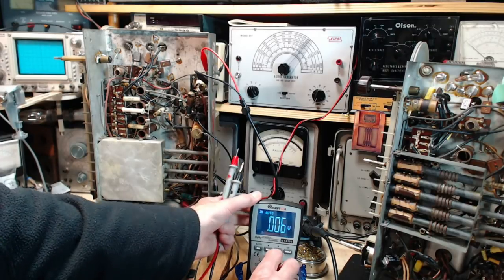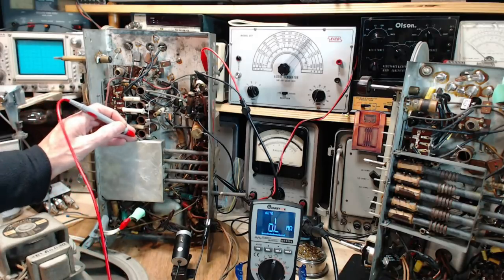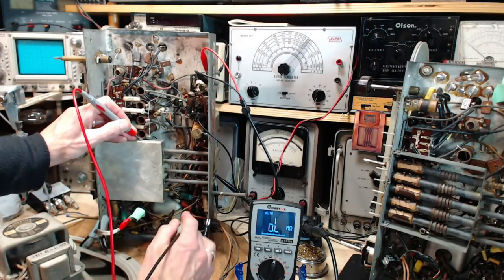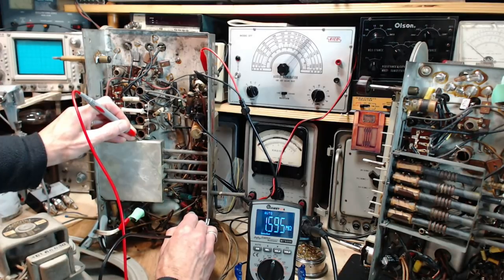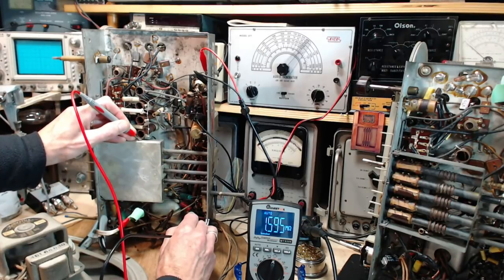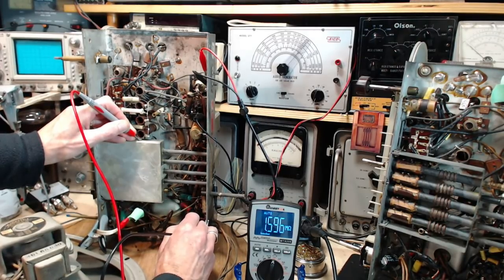So a resistance first. I have not concluded. Be a smart move. Down to the chassis, on this side of this capacitor. So I'm expecting this to be 470,000, 4.7 million, 47 million. Well, it's not going to be 47 million, that's pretty much an open circuit. 4.7 million sounds weird. 470K is really half a million. That's probably what it's supposed to be.